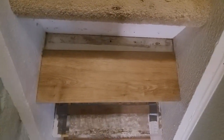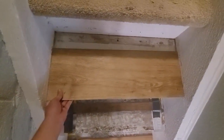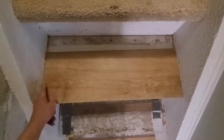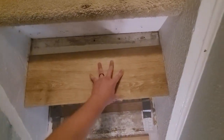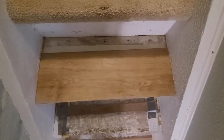I take that cardboard measurement to my tread and cut it. Here's the one that's been cut — I'm just dry-fitting it on the tread to make sure it fits. I've been getting a pretty good cut and fit. I might put some caulking on the edges to clean it up a little, but this cardboard jig is working pretty well to get the measurements.